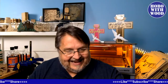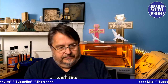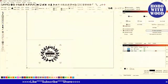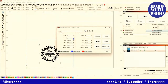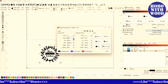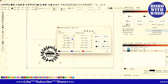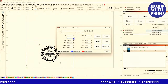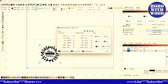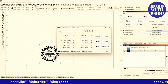Now, here's the test that I did for my 10 watt laser. Let's jump over to Lightburn, go into the laser tools material test. Now, I wanted to see just how fast, how much. So I did a 20 by 20 grid, but based on what I'm seeing here with the 10 watt, you would probably be sufficient if you did a 10 by 10 grid and started at maybe a speed of maybe 1500, minimum of 1500, and then a max.